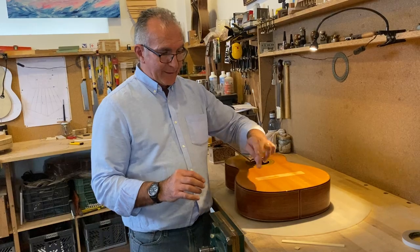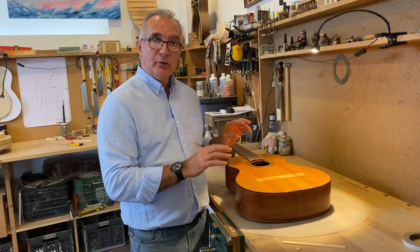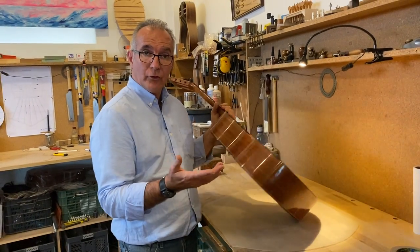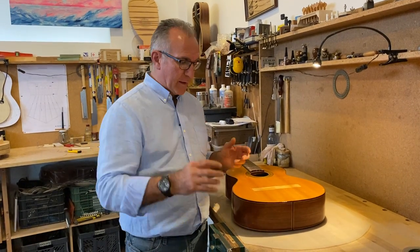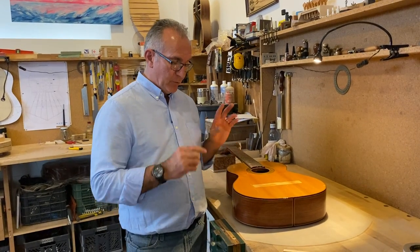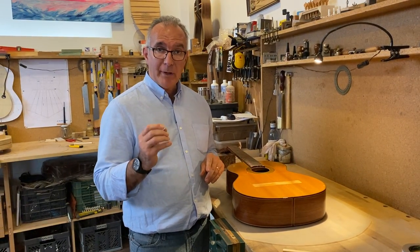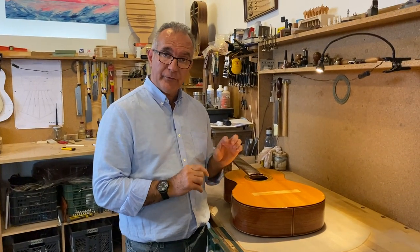To be able to glue the cleat, you could use a long clamp, but we're not going to do that. If you have a crack on the sides or in the back — which is also not uncommon — you won't be able to use a clamp. So I prefer to show you how to do it with magnets. The two key things of this job are how to squeeze the glue in the crack and the use of magnets to clamp the cleats inside, while also helping bring the two surfaces together.